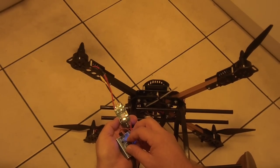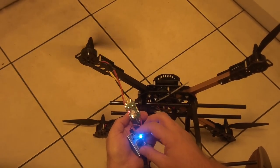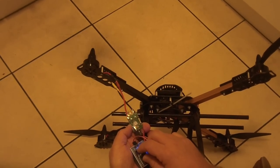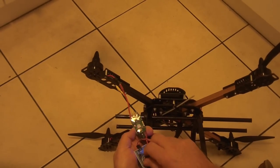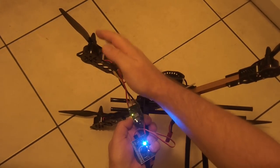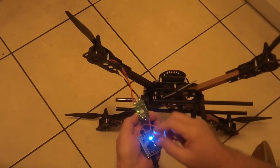I'll just run it. What usually causes the sync issue is when you have a very rapid acceleration on the throttle from a low RPM. You can see the red light on the ESC is showing that it's going out of sync, and the motor is stuttering quite badly.